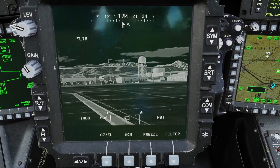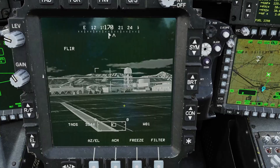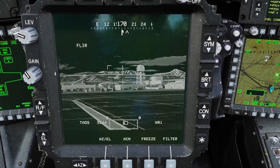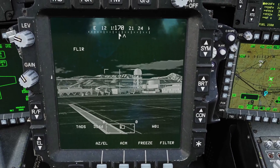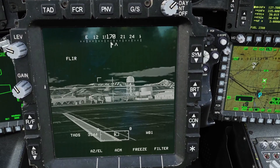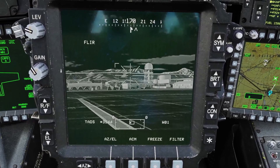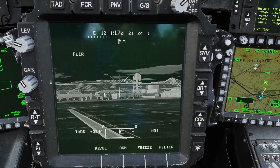If I point it toward something farther away and range it, you can see 3,500 meters away. The first detent does a single pulse. The second detent allows you to continuously range — if you hold down the second detent the laser lazes continuously until you turn it off. The first detent is just for getting range; the second detent is for designating a target and guiding missiles.